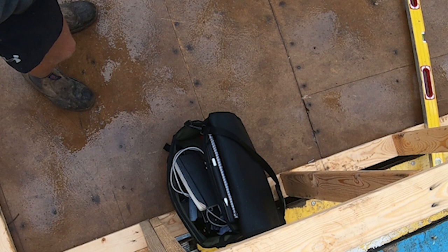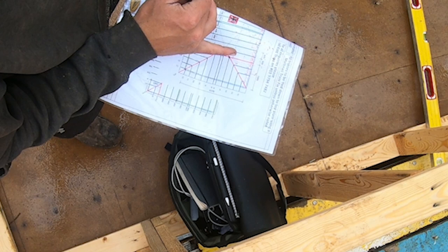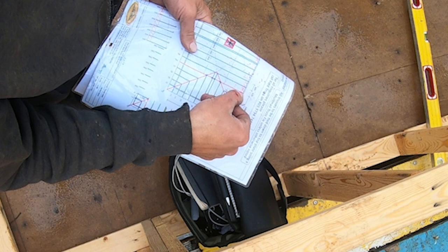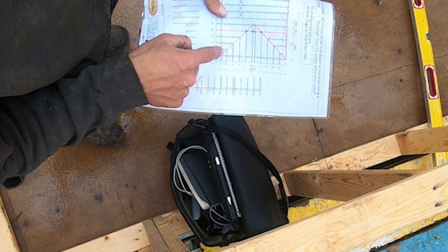So firstly, you want to start off at the right end of the building. So first, it's down here. And then you just run to this measurement. That's hooked onto the outside of your plate, and that's to the inside of your girder truss. So you hook on, and you find that TG1 truss and you stand it up there. So you get your parallel at each end, so you go 2-4 and 2-4.